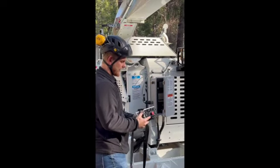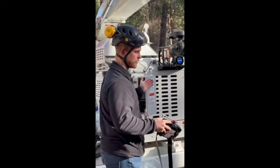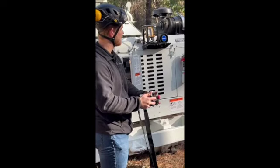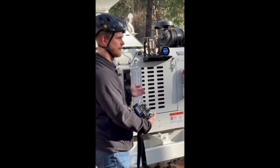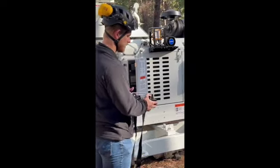When you see green, that means it's up, you're good to go. So I'm going to act like we started the machine up. Your remote is linking up. To move the machine forward and backward from your drive, you have to hold either enable button on the top. It doesn't matter which one, just one of them has to be held. Then your 2 biggest toggles are going to run independent track controls. So you can turn it on a 180-degree turn on itself.